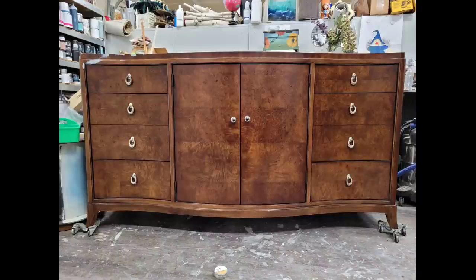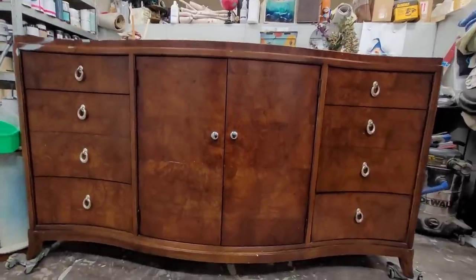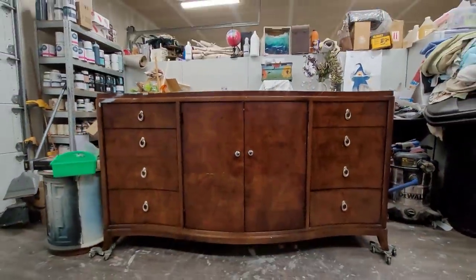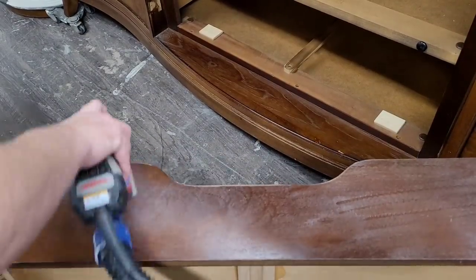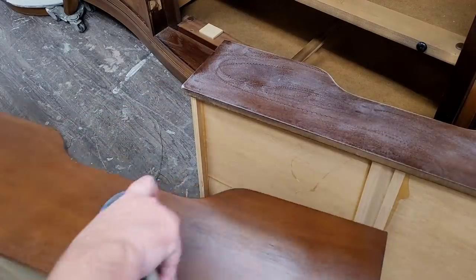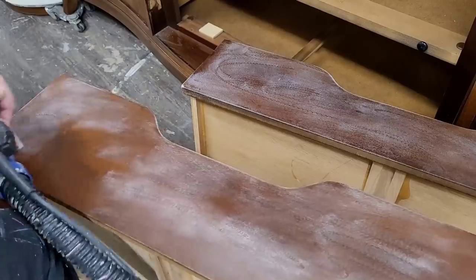Here's where I started on this dresser — it's a beautiful piece of furniture made by Thomasville. This customer had brought me the matching nightstands last year, and now we're going to give this dresser a different finish. This is the perfect example that even non-vintage furniture can be beautiful to refinish. I started off by giving this piece a really good cleaning using a TSP solution dissolved into water, then rinsed it away. The piece had a fairly glossy finish so I gave it a good scuff sanding using my SurfPrep sander.